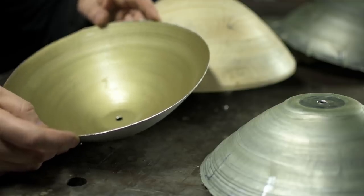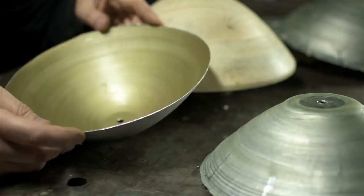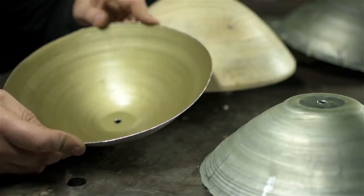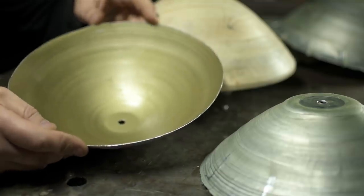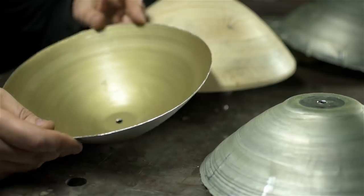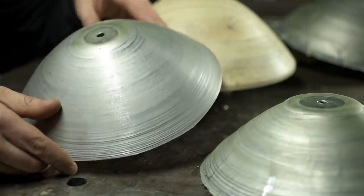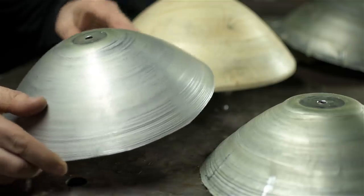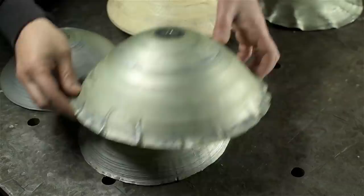They couldn't tell me what material it was, so no surprise there, but they did tell me it was from an appliance manufacturer. That made me think maybe like a 5000 series, which I think they use for deep draw. 5000 series, I mean, not appliance manufacturers. But maybe I just don't have the right stuff. Maybe it's work hardening or doing something weird. They did have some copper. They wanted a lot for it. And that stuff, I'm pretty sure, does work harden pretty easy. I just didn't want to deal with that.